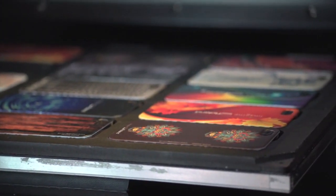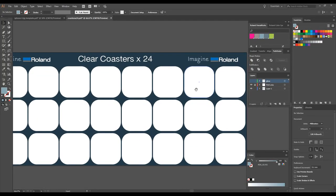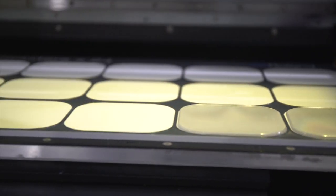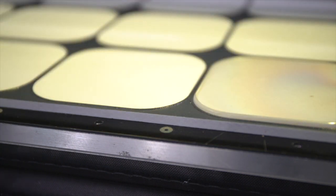Note that with this method you would not print with a bleed onto flat items, as the oversized parts of the graphic would overspray and mist inside the machine. For printing raised surfaces with a bleed you would need to create a consistently flat surface for the items to sit into — we will show this later. Similar to the draft printing mode, another method would be to print a gloss ridge using the clear ink channel of your machine. This gives you a physical lip for your item to slip into, making placement much quicker and easier.